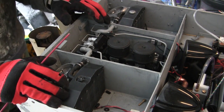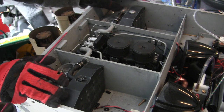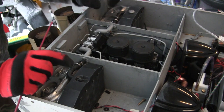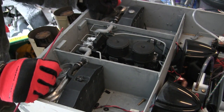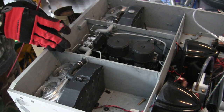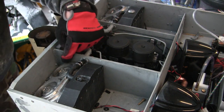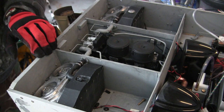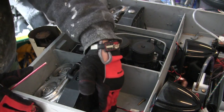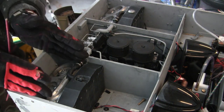Because of modifications made to these locations discussed in a previous video, the likelihood of needing to access these locations will be quite rare. However, if the need does arise, the engine as well as the fans are held on via fasteners, and the other components are held on with small adhesives. As for the fans themselves, they are located directly over the idler mount bases. Because of their location, small access holes are cut into the engine compartment lower floor to get access to those locations. The fans are mounted to the hull via a large panel that is bolted to the tank. By removal of the fasteners, the entire panel along with the fan and radiator clutch will be removed and lifted out of the way.